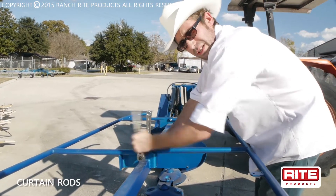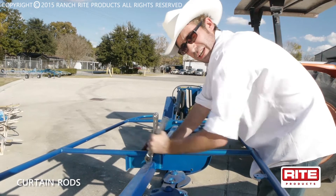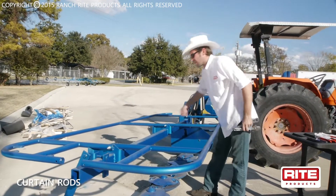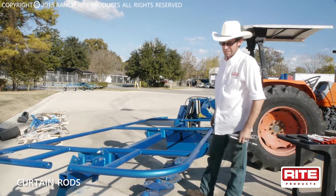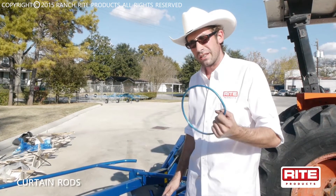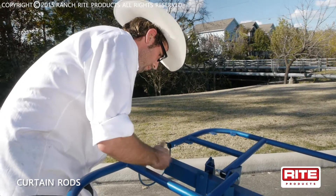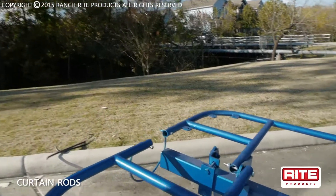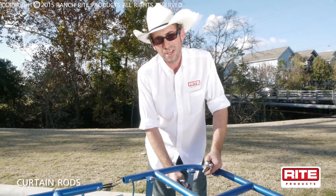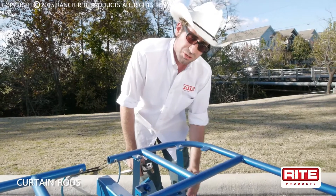After you get your curtain rods on, install your bolts and tighten them all up. Don't tighten them too tight because otherwise your curtain won't be able to flip over back in front — just enough to get snug and get past the nylock on the nut. On this model, the curtain rod picks up on front and backside for ease of access when you have to change your blades or you just ran over something and want to know what it was. The next step would be to install your stanchions for your curtain rod — the hoop on the end and the downward pieces to keep your curtain from flapping in the wind. Then put the downward supports for your canvas on your frame using a 13 millimeter bolt. Make sure your supports are facing inward where the curve's facing in, so you don't rip a hole in your canvas.